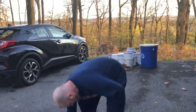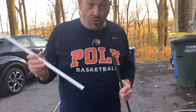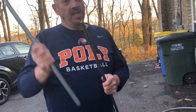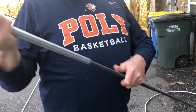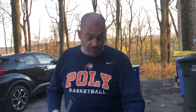Now here are your options for putting this in the ground. You can take a piece of half-inch rebar. I've found it depends on the store and their stock, so check before you leave that the rebar fits inside of the EMT. Some stores it fits perfectly; others have an edge that keeps it from fitting even though it's labeled half-inch. If one end is a little messed up, that's the end you put in the ground, as long as you have one clean end your pipe will slide onto. I just don't want you to buy rebar and get home and not be able to use it.